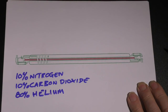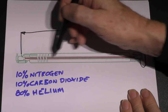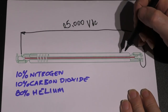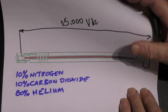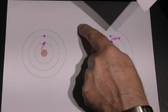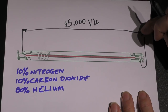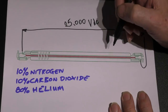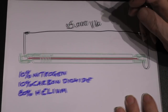If we put 25,000 volts across the end of this central tube, the nitrogen element of the gas mix will start to break down and release free electrons. These electrons burst free from their orbits and float around — those free electrons are what carry current through the tube, electrical current through the tube. All of a sudden this nitrogen becomes almost resistance-free, like a piece of wire — it becomes conductive.